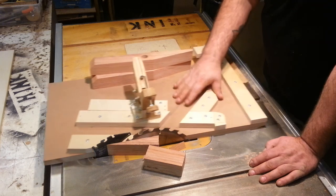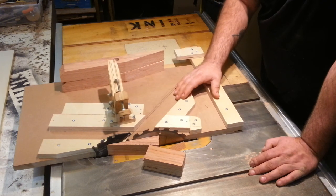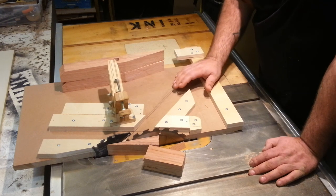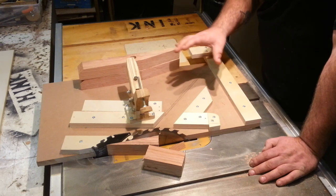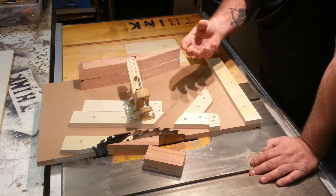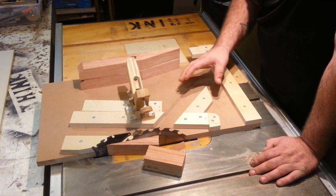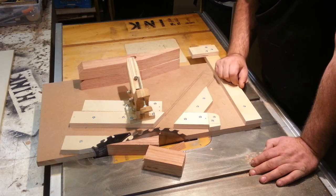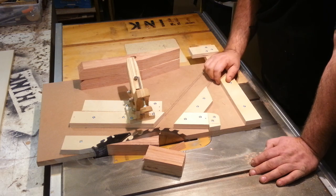Really, when you're doing production work, you want to handle the material as little as possible. With jigs like this, where you're setting up to do production work, if you can make that jig do all the mill work — or at least a good portion of it — it makes a huge difference in production time. Set yourself up where you're handling the material as little as possible, and when you do have to handle it, accomplish as much as you can each time. Thanks for watching, guys — don't forget to like and subscribe. Much more fun stuff and crazy tips coming, and we'll talk to you all soon.